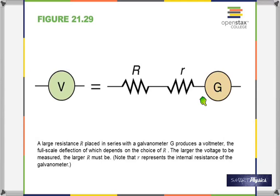Okay. So every galvanometer is used to detect a current. Have you ever heard of a detective? A detective is a most sensitive person. Am I right? Very sensitive. A galvanometer is a very sensitive instrument. It cannot be used to measure currents. Point to be noted: it can only be used to detect a current. So if you want to know if there is a current flowing in a certain part, you connect a galvanometer, and it'll give you a deflection.